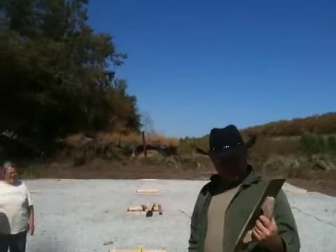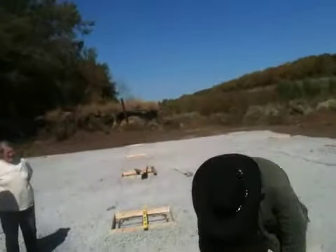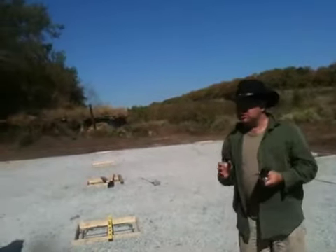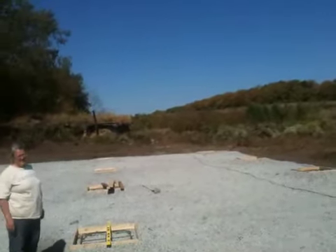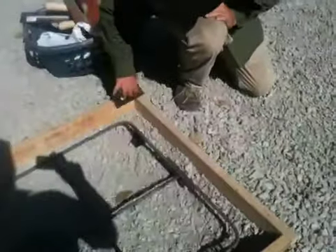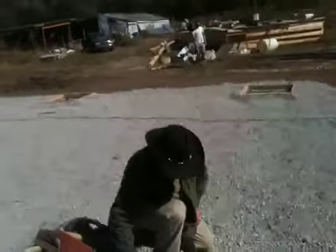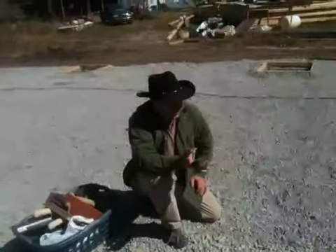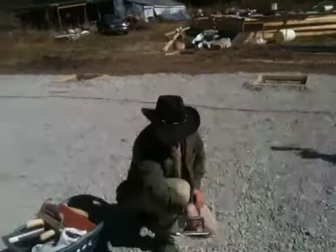So we want these to be as clean and as smooth as possible. After it's smooth, we also have edges. The edger is going to keep us from breaking off the corner of our slab — we want it to be rounded so you won't break it every time you nick it with your foot. It'll run along the edge of the concrete and make a little rounded groove. You've seen the edges of sidewalks where there's a strip that's been run along the edge and then it's brushed in the middle. So once the concrete is stiff enough to hold the shape, we can do the edging.